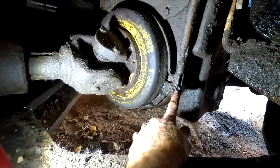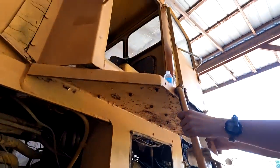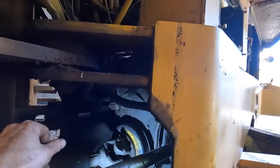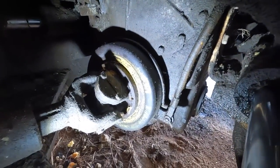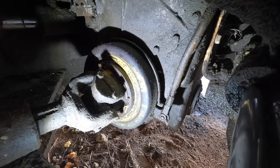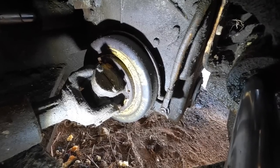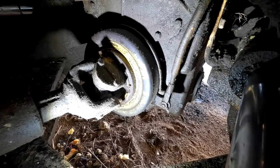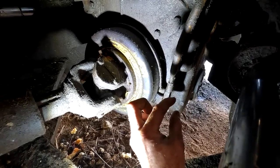So right here is the parking brake. Why don't you jump up there and pull that? Just gently lift it up. So he's gonna lift it up. We're gonna look at this mechanism here. Is it up? Yep. And now down? Down. That's down all the way? Mm-hmm. That might not be disengaging enough because it's literally only moving like half an inch.